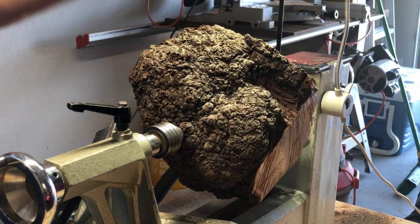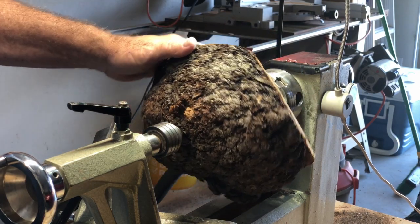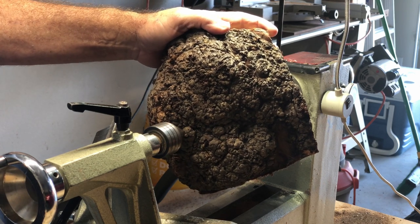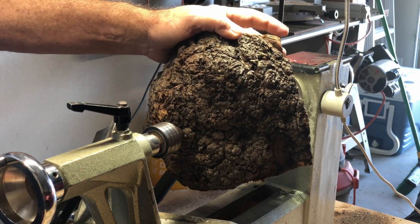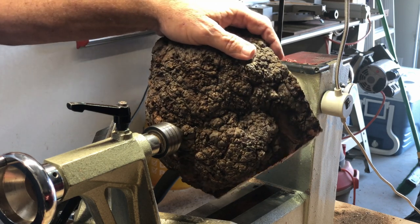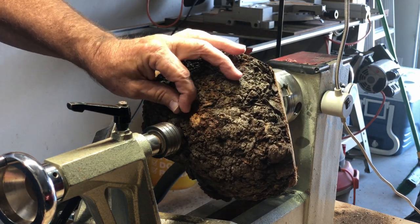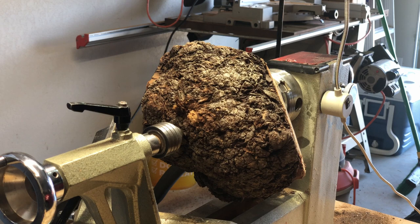But I thought I could get the most out of this from this direction, so we'll see. But I'm not even sure we're gonna be able to turn it. I think I still have some problems with my lathe. The last time I just replaced the controller box on it, so it does turn on, but when I was screwing this down, it wanted to hang. So I took the brushes out, cleaned them, put everything back in, and we'll see if it's actually going to turn it or if it's going to just stop dead in its tracks, and I'm going to have to think about replacing the motor. So let me get my face shield on, and we'll see what happens.